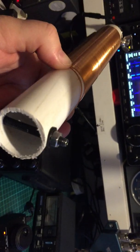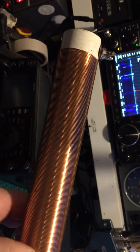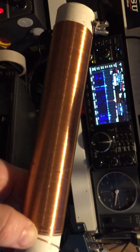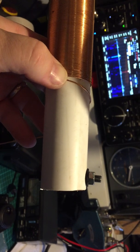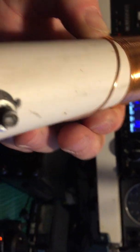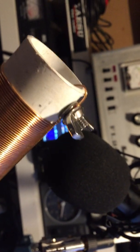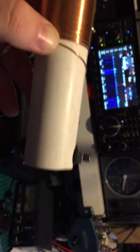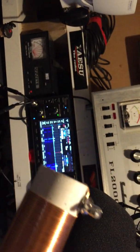It's Saturday before Easter Sunday. I'm in the shack early this morning — I'm an early riser. Cost of it: it's cost me £6. I had the pipe here — it's 28 centimetres I've cut the pipe to. Just another bolt there. I've cut a hole in there for it to come through once I've finished the winding. It's not soldered yet — I'm going to solder it obviously. So the 40 metre end fed wire antenna will cover 80 metres once this coil is on, with a 2 metre length of wire at the end of it. Then we'll check the SWR and hopefully, fingers crossed, it's alright.